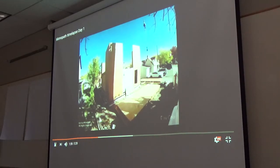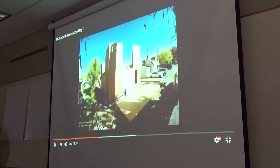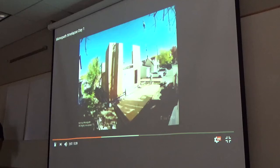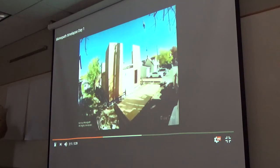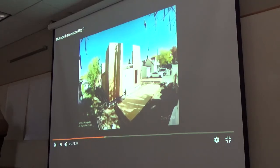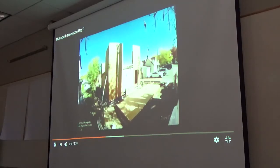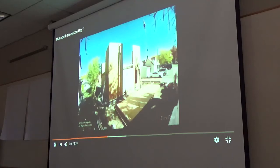And so all of the exterior panels will be in place? Nope. In this case, the infill panels on the exterior, there's 8 panels missing. There's 2 on either side of the long side and 1 on the front and back. Those are the last panels to go in. Is that just to get the trusses in easier? It's for the trusses, it's for clearance. We have line of sight to the crane. It's access. We don't have windows cut out.